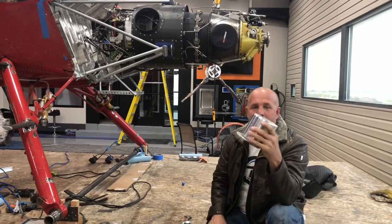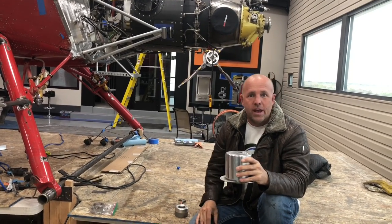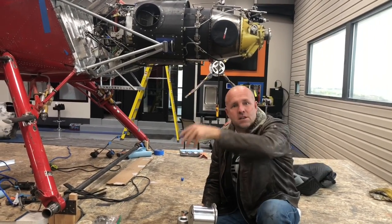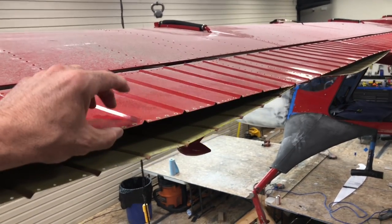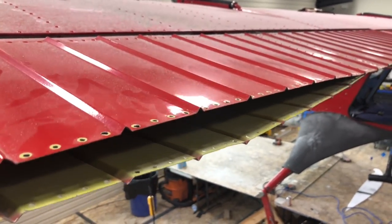I've got that fixed. I've made this a lot taller - I'll have to put a fairing on the back, probably a blending fairing on the front, and I'm redoing all the vent lines, arcing them higher on the wing. I'll put some big fairings on top of the wing that'll also act as a fence. I just got to the airport - it's about 11 o'clock at night and I've got a lot to do on Draco. I'm going to focus tonight on splitting the ailerons, flaps, elevator, and rudder and opening them up - extending them a couple inches each as I enlarge the wing.